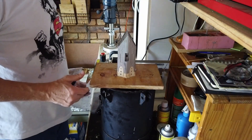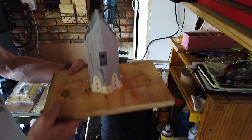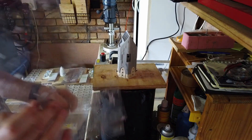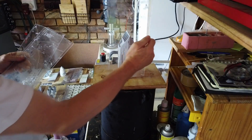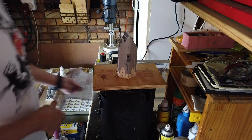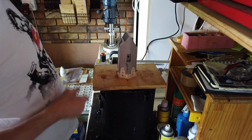I'm back with the main body of the beaming model and I've mounted it this way on the piece of wood. I've got these white pieces of polycarbonate plastic which I'm now going to put around, about one centimeter on each side. Once that's done I'll show you how the pull mold works, because I need to remove all of this putty through the hole and then refill it.